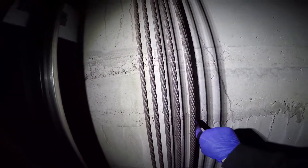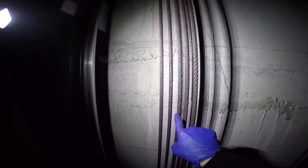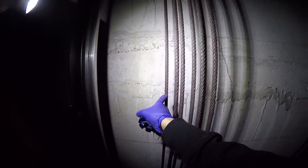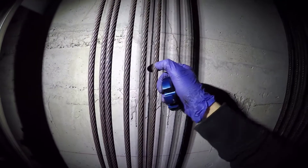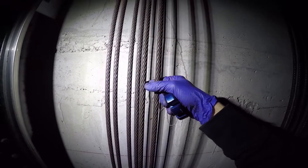The other thing to note is the tension on these ropes. If you do have unequal tension on the ropes, that causes an unfavorable condition for the hoist ropes, and the elevator code does speak to that. With unfavorable conditions, if there are any broken wires in the hoist rope, then you only need half the required number of broken wires to warrant replacement.